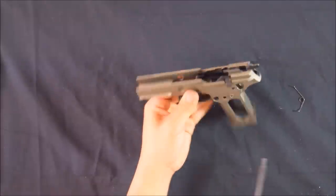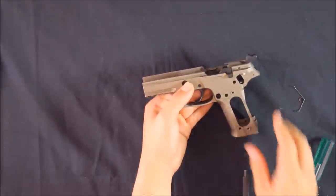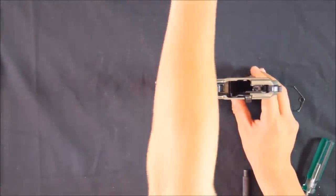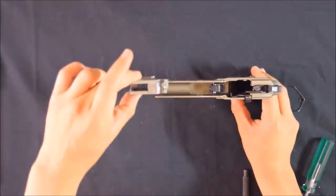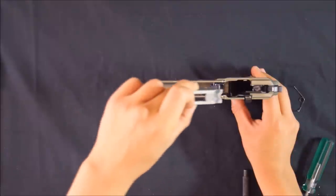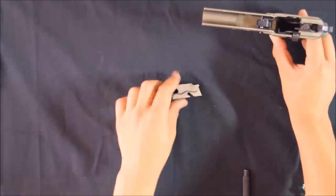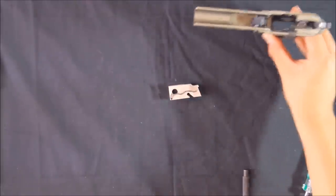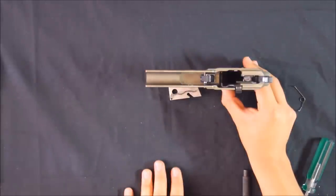Make sure the pin is horizontal with the frame — it's either this way or 180 degrees because the notches need to be on the bottom. The locking block needs to go back in just to hold everything in place and prevent it falling apart. The locking block goes in angled downwards and then slotted into place — from front to rear while also going downwards. This spring needs to sit in this hole, up against the upper face. When putting it back in, make sure the slide catch lever is pushed right up against the left wall of the frame and everything else should hold itself in place.